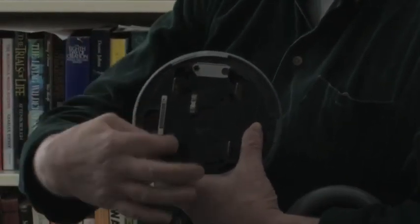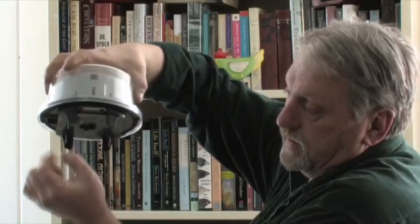Those grippers that bite the bar are expanded from years of housing the analog meters, and these new bus bars are much thinner. It's basically like a pinch bar — you push them in and they grab onto the meter with tension. Over time, heat causes expansion and contraction repeatedly. Electricians run into this quite frequently with plugs in the home; with heavy use, screws will literally loosen themselves, even in the panel.